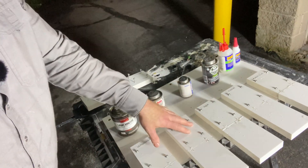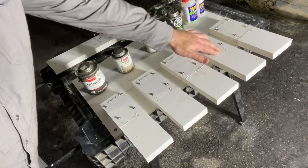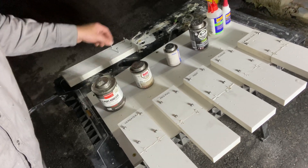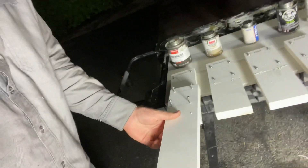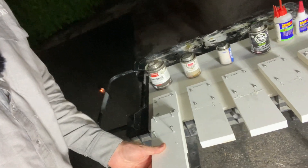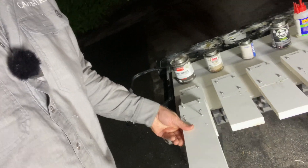What we've done is set up each one of these sample pieces and aligned the joints, which we're going to test, directly on the edge of this PVC panel. I'm using a piece of equal width, aligned on the same joint to extend the piece out so that there's more leverage for the water bucket that we're going to use as a weight. We're going to add water to a five-gallon paint bucket and then record the weight at which the joint breaks.